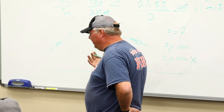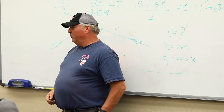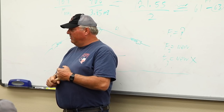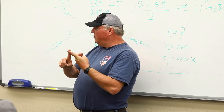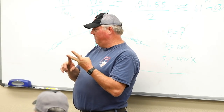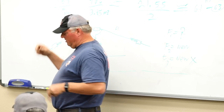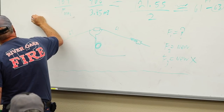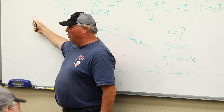Yeah. Oh, I literally went to Home Depot, and I'm that nerdy guy, not nerdy, more like weird guy, that walks around, goes to the plumbing department and the electrical department, and you find there's three different kinds of tubing. Four. There's rigid conduit for electrical, okay? There's IMC, intermediate conduit for electrical, and Home Depot has a little bit of both. The difference between the two is the internal diameter. So the schedule of it? Yes, exactly. Schedule. The IMC is thinner than this, so your ID, there's more room.